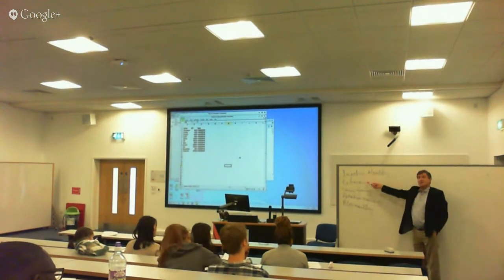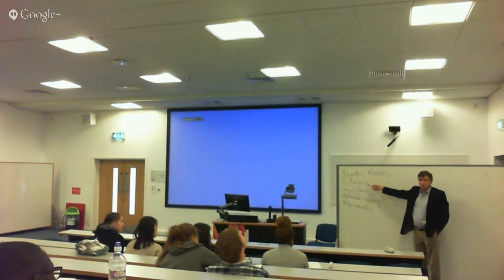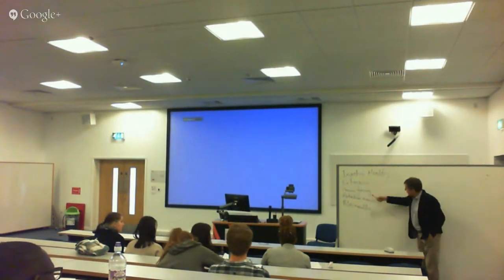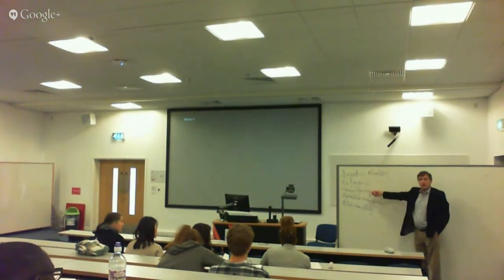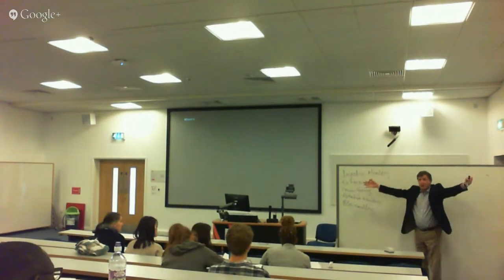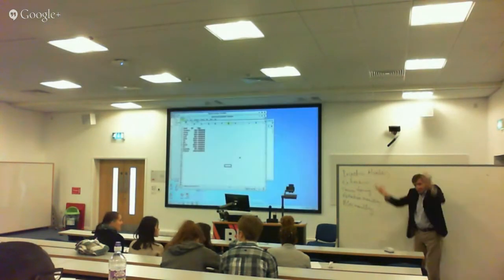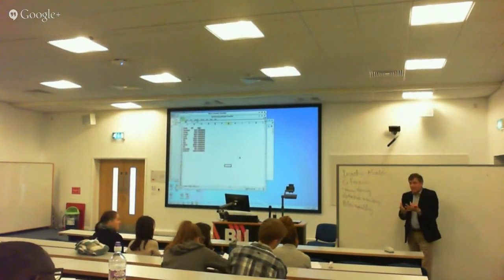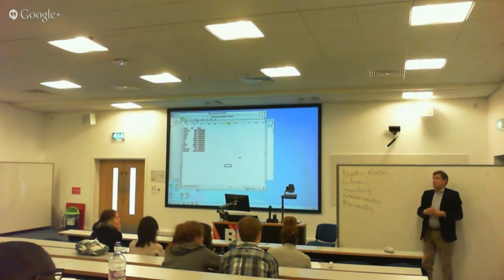Extrusion, what is that? Not like metal extrusion. Softening a plastic and forcing it into a die. Vacuum forming, which some of you product designers have probably done, is very simple. A sheet of plastic, you heat it, you soften it, then you produce a vacuum and suck the sheet into the shape you want your plastic to take.